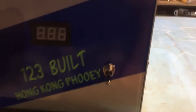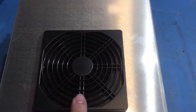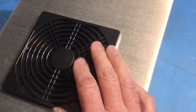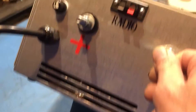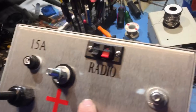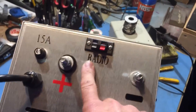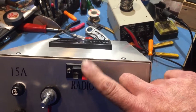I actually have it plugged into a power strip, so you know that's weak. Anyway, this unit here is obviously very light. It has a 92 millimeter fan with a filter, 120 millimeter fan — just because I like putting filters on things. On the back of this unit, obviously you have positive, you have negative, you use a 15 amp fast blow fuse. Then you have a radio terminal output, so it'll run up to a six amp radio and it will measure a different voltage than what's at the actual front.